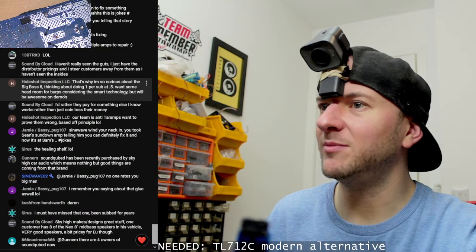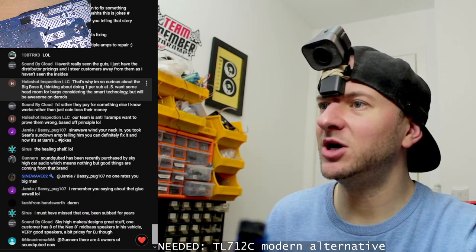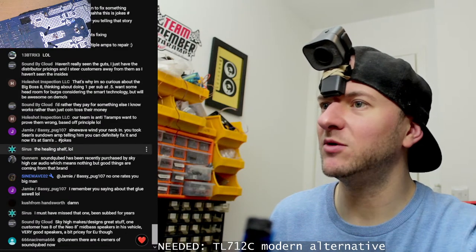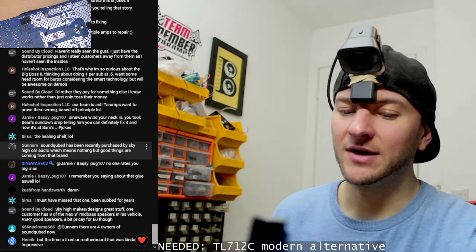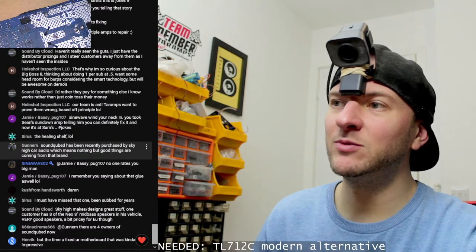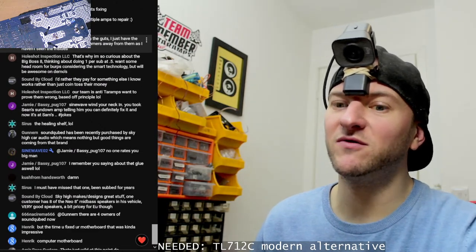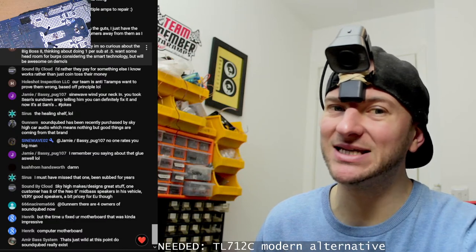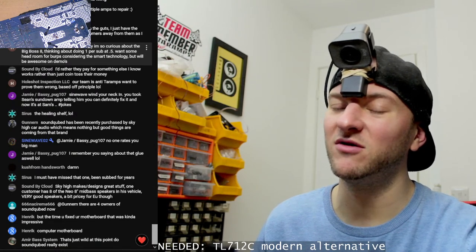That's why I'm so curious about the Big Boss 8, thinking about doing one per sub at 0.5. Want some headroom for burps, considering the smart technology, but it would be awesome on demos. Yeah, so basically the Smart 8s, the Big Boss 8 and the Smart 8, they're great, provided that you don't ever want to clamp above 8K. A lot of people who have bought these amps and are doing big stuff, especially wiring to 0.5, would have actually been better off with a base 8K. Because for certain frequencies, they're actually asking for more than 8K per amplifier when they're wired at 0.5.